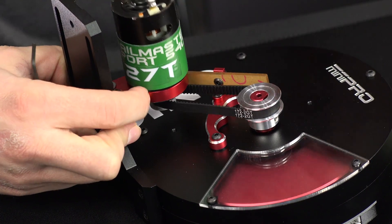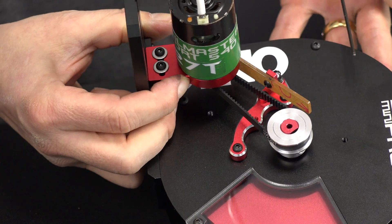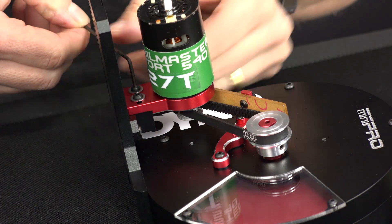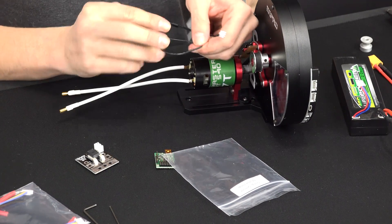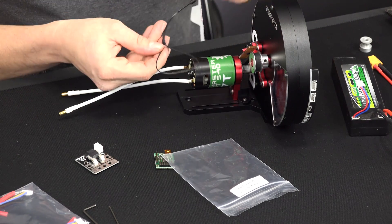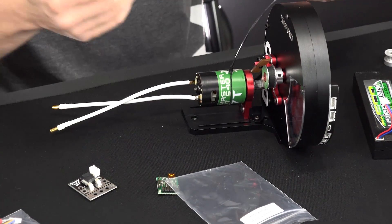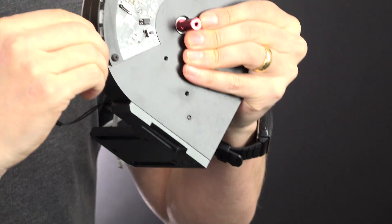I'm going to put a little side pressure with my finger here — you can see how it adjusts the tension as we slide away from the main pulley. Our very scientific method today is finger tight — it's too tight for two fingers so we're going with one finger of tension. That was kind of difficult to assemble. This temperature sensor is interesting — it's probably just an RTD sensor, essentially a resistor that changes resistance as temperature changes. It's a loop that you wire-tie around the motor. We plug that in over here, and they were smart enough to make the temperature sensor connectors all two-pin.